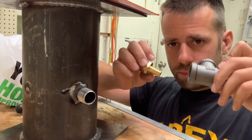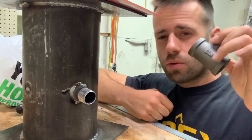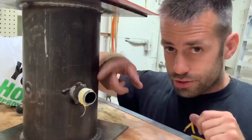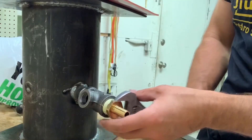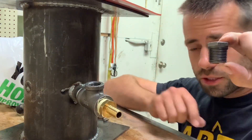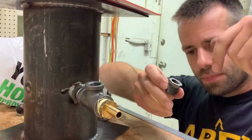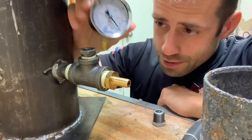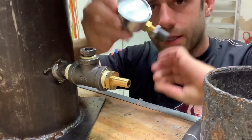For the outlet, I got a series of pipes that I'm going to screw on here and seal up with some Teflon tape so the vacuum holds. I had the tape on the wrong way at first. This little piece necks the half-inch opening down to a quarter inch, and that's what's going to hold my vacuum pressure gauge. I got my vacuum gauge but it was the wrong size, so I got another part to make it the right size.